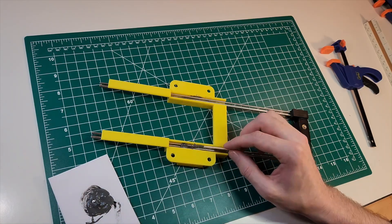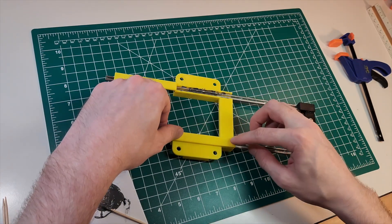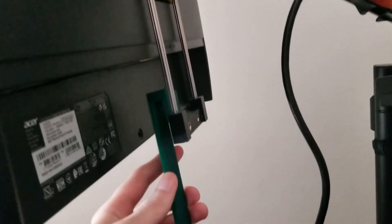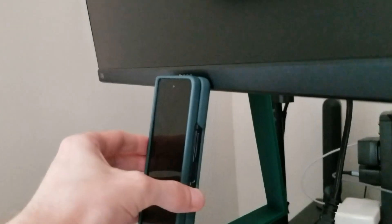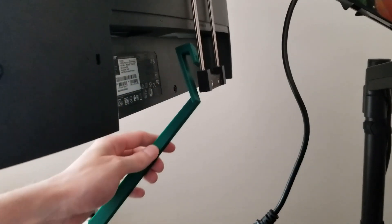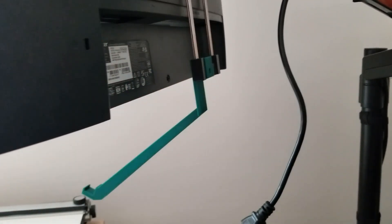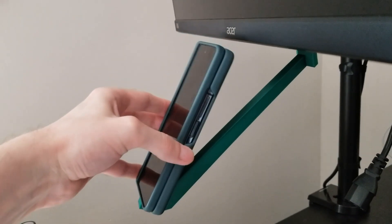They are held in place with a generous blob of JB Weld with a cap to hold everything in place. This method allows me to spread the JB Weld along the surface of the rods to ensure a strong connection. I designed the bracket and frame before I figured out how the phone holder would actually connect, because I needed to establish a reference point in the real world to work from while designing in the computer. With the frame in place, I printed a series of tests to determine exactly where the phone holder wanted to be relative to the monitor. This was much easier than actually trying to measure the monitor itself.